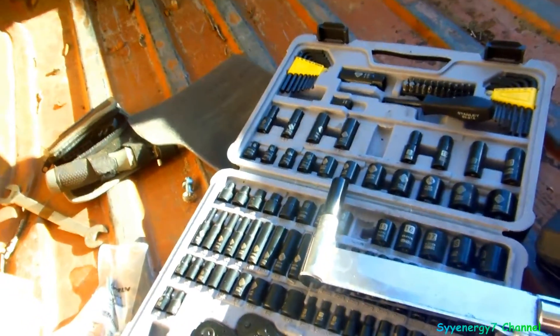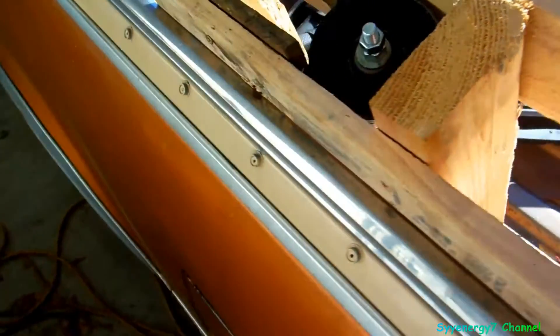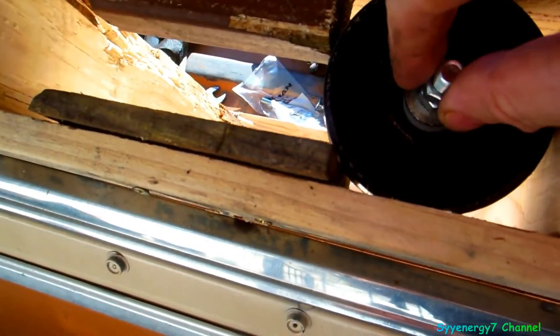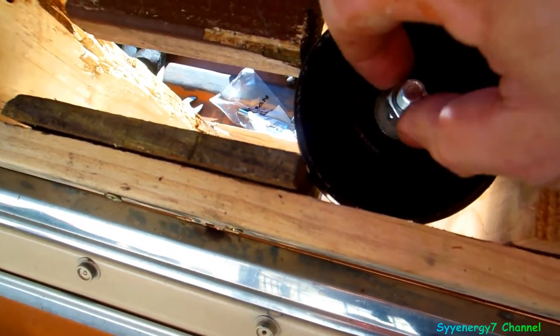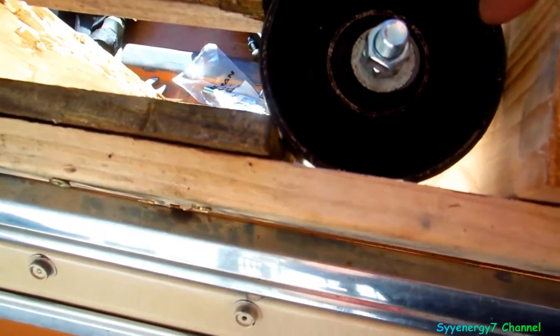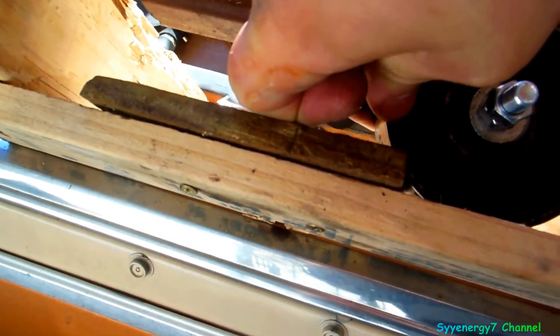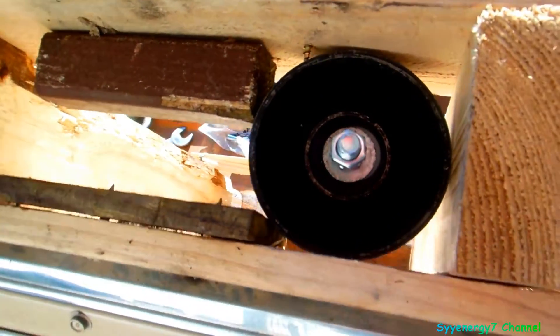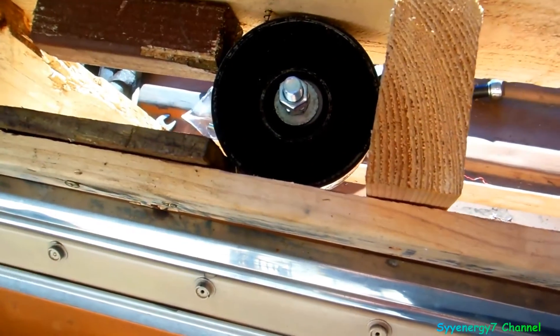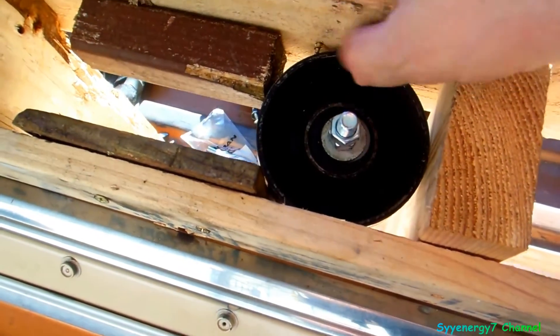This is not a bad setup to have around; I'm going to keep this in the shed. All I had to do was jam the pulley bearing in here with some washers — it's a bearing so it spins nice and free, maybe an inch-pound of resistance, which is plenty good enough for checking. It's jammed up in the wood with a screw and a piece of wood against it, nice and tight. I won't be able to check like 50 foot-pounds with it as-is, but it's plenty good enough for checking inch-pound wrenches.